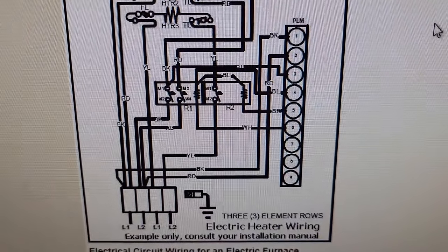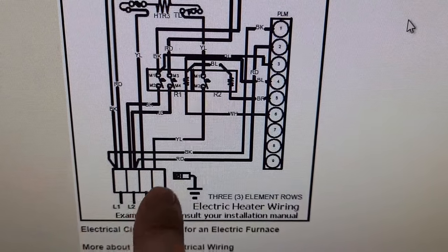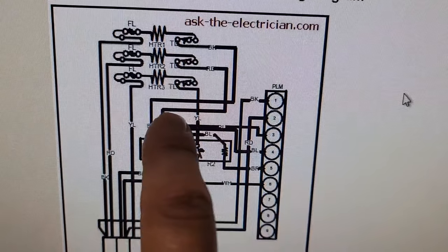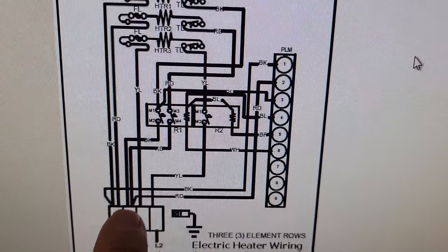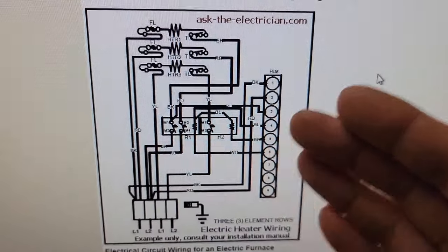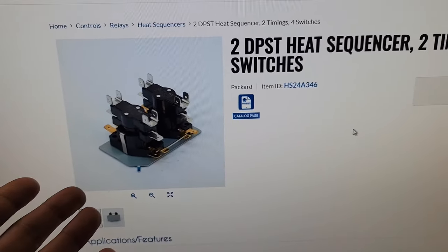Got a wiring diagram here - just want to show you how the heater is wired. You've got 230 volts, L1 and L2. That's one breaker, and then the other breaker, L1 and L2. So you've got a black wire going into the heater, and then coming out of the heater and going into the M1 contact. And then out of M2, you've got another wire going back to the other side of the line. That's how you wire a heater and a sequencer. You can type in the Google search bar Intertherm electric furnace wiring diagram. You can also go to PackardOnline.com to learn more about these heat sequencers.